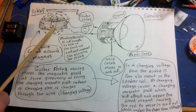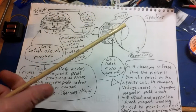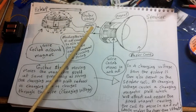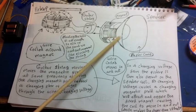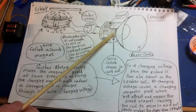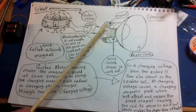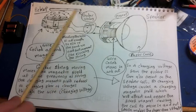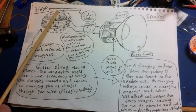We've got a coil of wire wrapped around a magnet — north and south — with the magnetic field lines coming out. Along the top is a guitar string. When we pluck it, it moves fast and modifies the magnetic field at the same frequency. That's connected via an amplifier to a speaker coil — coiled wire — where charges move back and forth. Those charges produce their own magnetic field, which interacts with the fixed magnet: sometimes repelling, sometimes attracting, pushing the speaker cone in and out at exactly the same frequency. This is all Faraday's Law of Induction — induction at the pickup and induction at the speaker.